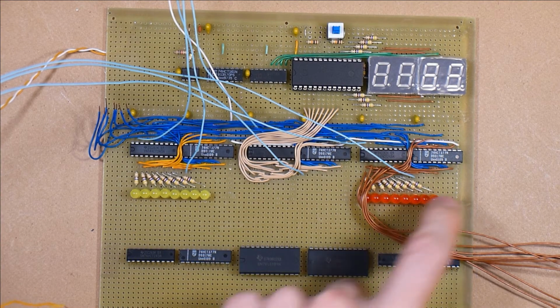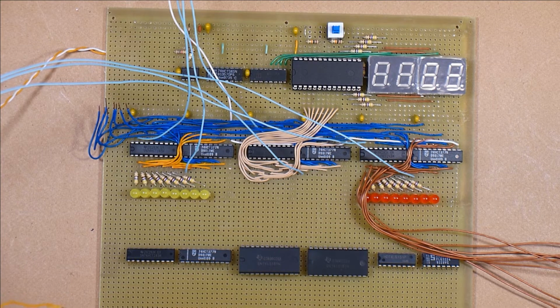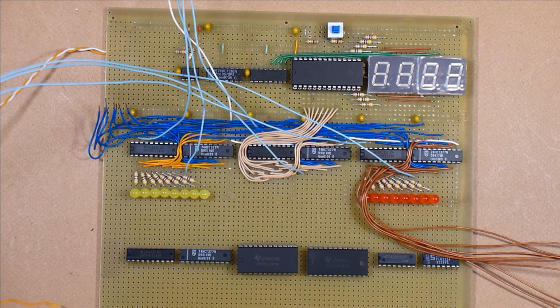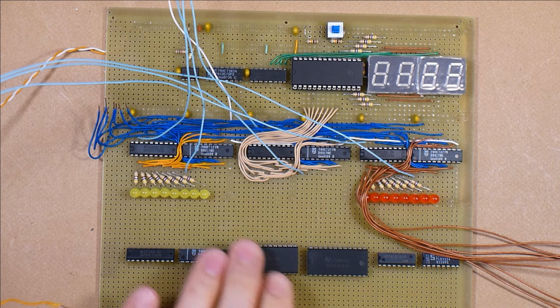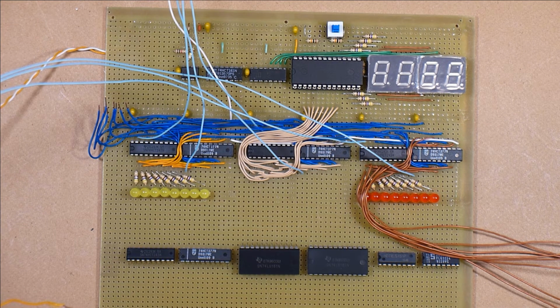The next segment we're going to build here under this register we just tested is the ALU, or Arithmetic Logic Unit. And I will base this unit on the famous 74LS181 4-bit ALU. This ALU is the ALU on a chip. It's very known from the past, from the late 70s, I guess. And it implements lots of mathematical and logic operations. And we're gonna be using it. I'll explain more about this IC on the schematic part.